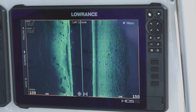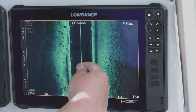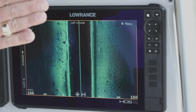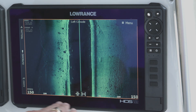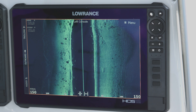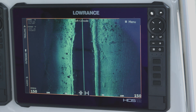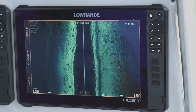A lot of people find interpreting a side scan image is their biggest issue, but it's actually quite simple. This center line is the very top of the water column — that's where our boat is. From that center line, where it's dark all the way to where it gets bright, that's the water column. Using the scale at the bottom — 0, 50, 100 — I can interpret that we're in about 25 feet of water. We've also got these big fish we're marking: they're called spoonbill or paddlefish, and I can estimate that one is in about 10 to 15 feet of water.